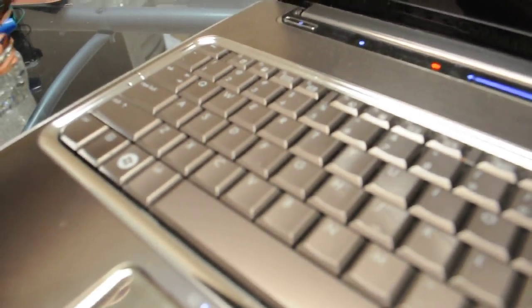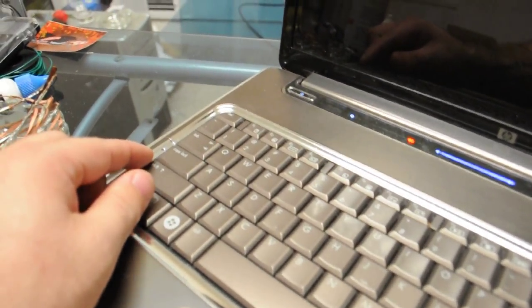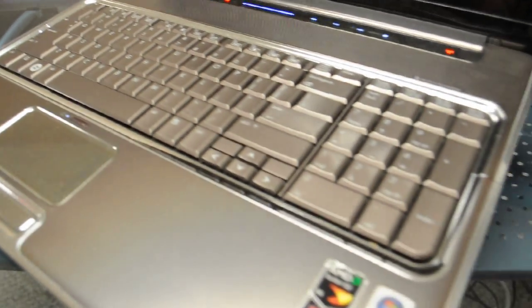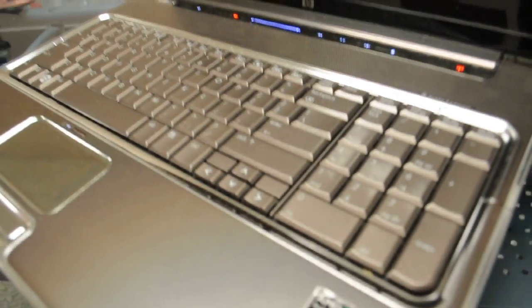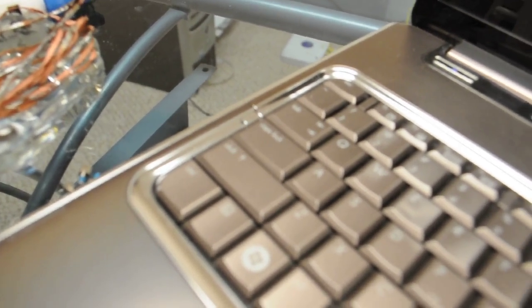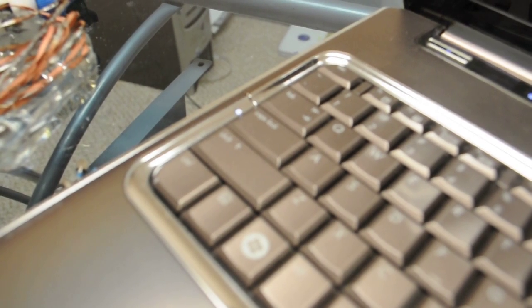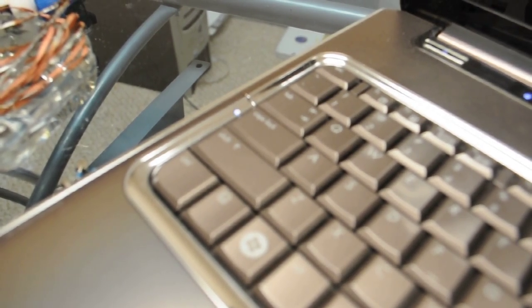you know that is telling you that you have a memory problem. See how it's blinking right there, that memory problem is either internal memory or VRAM. So what we're going to do is break this system down and then go from there to see if we can't figure out what's going on. Either we're going to test the internal memory or reflow and see where it goes.